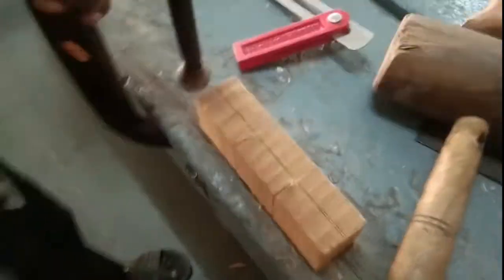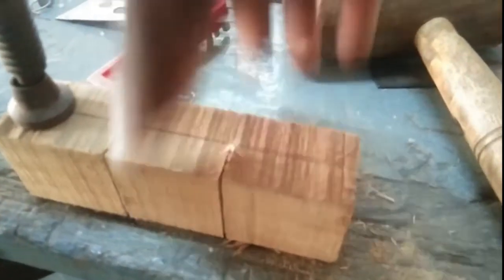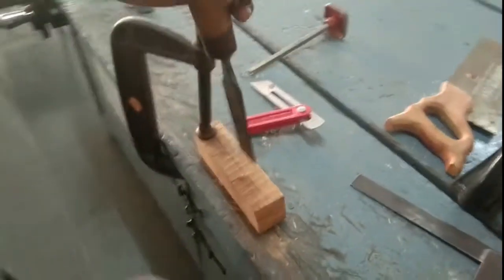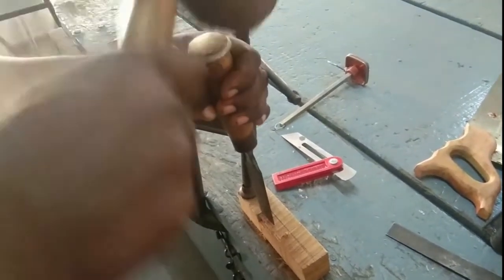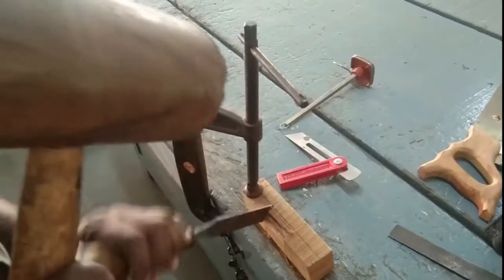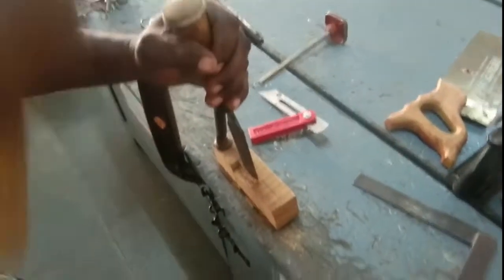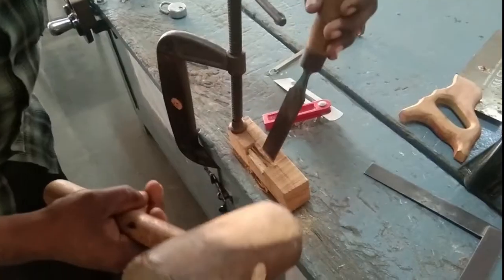He then works on the second, female part of the wooden workpiece. The saw cutting lines are already present, so in between the two saw cutting lines he removes material to make the cavity on the workpiece. From this cavity only the two pieces can be joined with each other perfectly. He utilizes the plain edge chisel and removes the unwanted wooden material from the required area, using the same hammering and chiseling action to achieve the exact required dimensions.